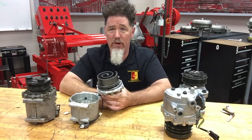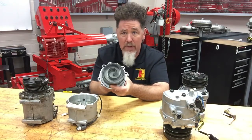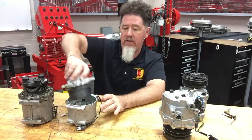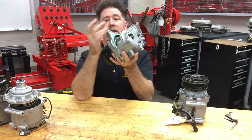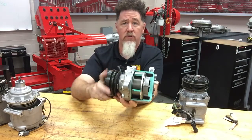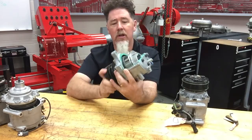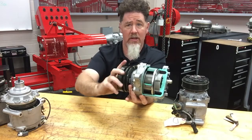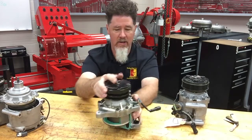I don't recommend trying to take these apart — it's just to understand how they operate. The key point is that when I turn my input shaft, the scroll oscillates — it does not rotate. I had a student in our fabrication area do a cutaway for me, and you can see as I turn the input shaft, my movable scroll right there is oscillating around. I can hear a little bit of air squeezing out. My fixed scroll is this piece right here, and my movable scroll is inside there — you can see how it oscillates.